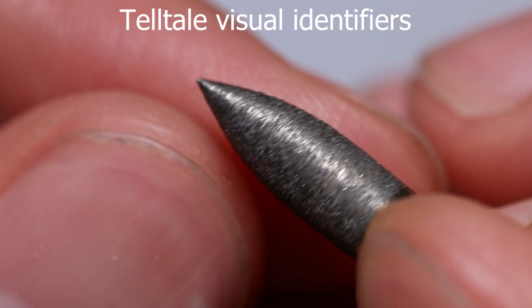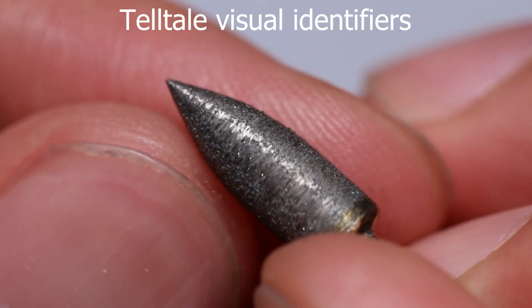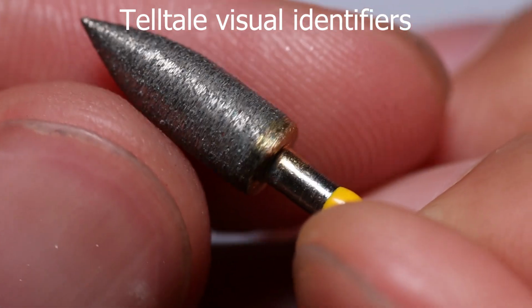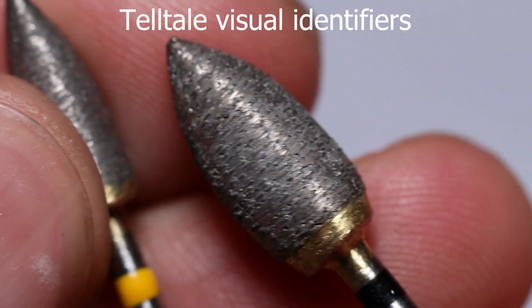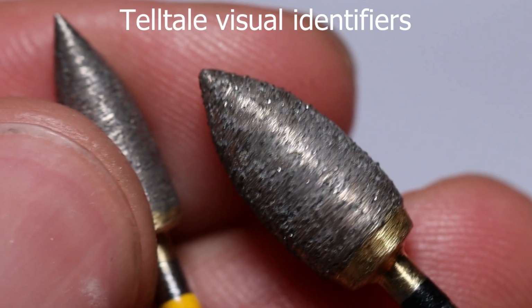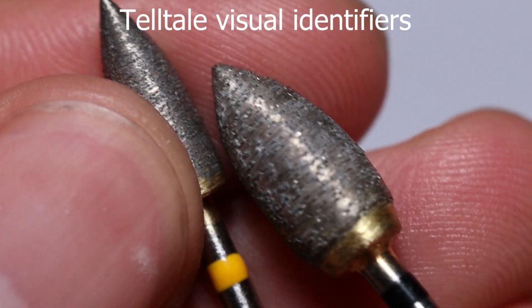It's actually a fairly porous material because when you mix those 2 powders, the metal powder and the diamond powder, you're also going to have little gaps between each of those granules, and it's not going to fully disappear, so you get these little air pockets. So you want to look for that giveaway little brass. And if I bring in that other burr, the bigger one, you can see how obvious it is, that transition between shank to that end piece to the actual material itself. And you can see there's a little bit of a twinkle, and that's the diamonds that are already exposed. But if you have a good look, there can be little air pockets here and there, covered diamonds, exposed diamonds.